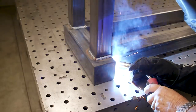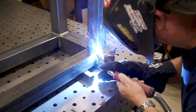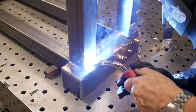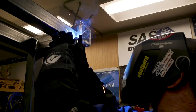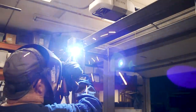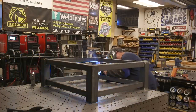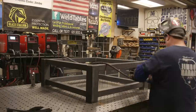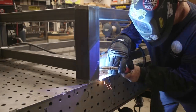I'm just trying to get some nice little welds in there. There are lots of different ways to do it - lots of welders use different methods. I like to use a small cursive E or small circles; that seems to work best for me. There are lots of different ways but they all seem to get the same results - it's just what you're used to. I'm showing all kinds of different angles here going downhill, underneath, horizontal, and flat position. That part of the table is almost complete. It's starting to take shape and it's kind of fun seeing this thing come together, though I am getting a little concerned about the weight.